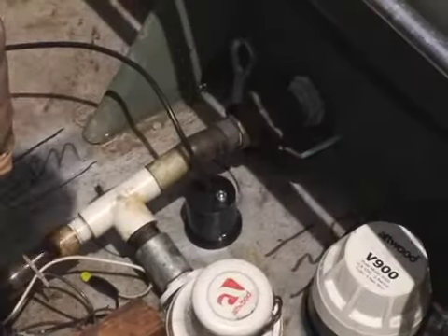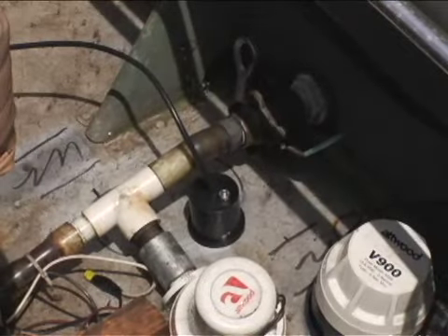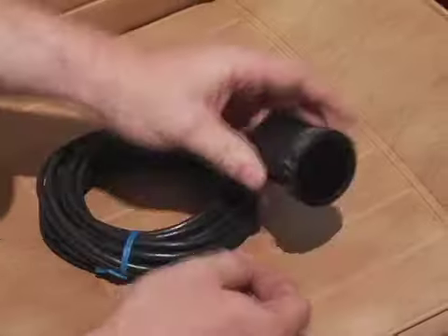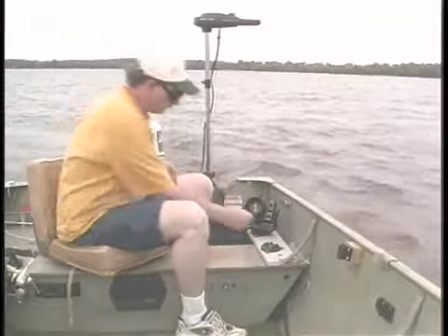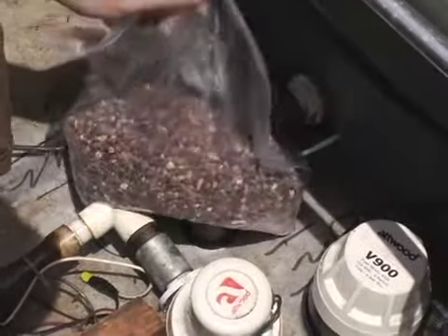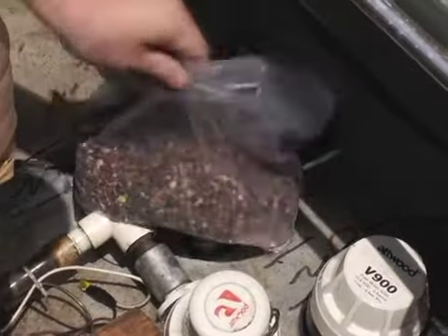To do this, fill the rear area of your boat with an inch of water before you permanently epoxy the transducer into position. Remove the protective film from the transducer face. Go for a boat ride and use a small bag of sand or gravel to hold the transducer firmly to the hull and keep it under the thin layer of water you have in your boat.